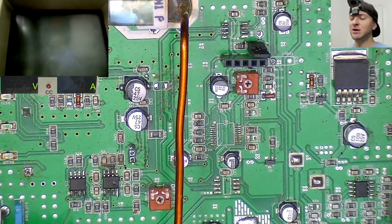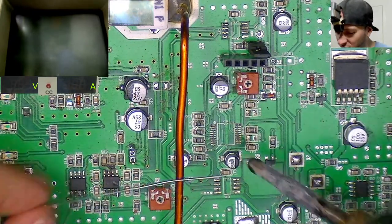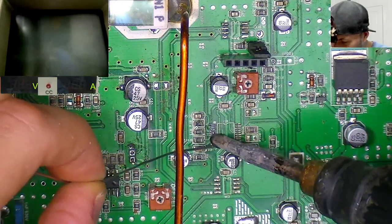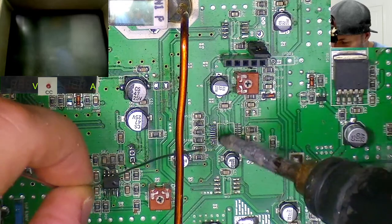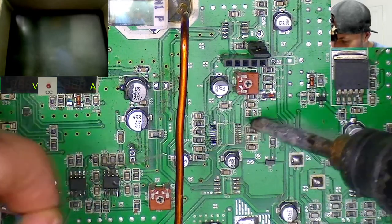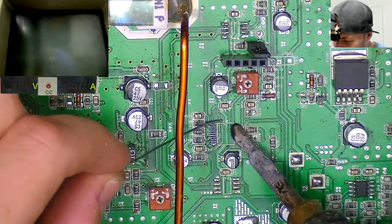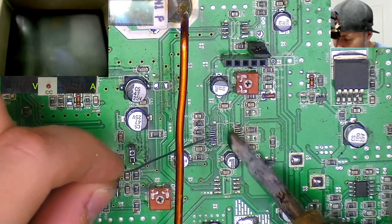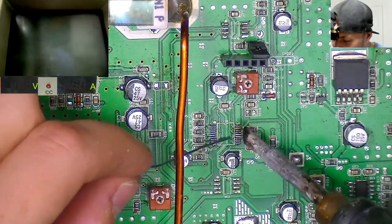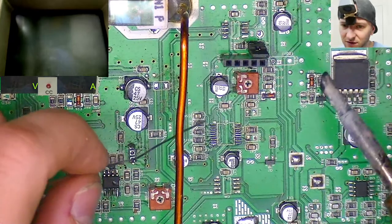So if you want, take the back off and send me a picture of the output inductors to facebook.com/bearids. I'll have a look and see if it's one of the ones with the weak inductors, where they have issues with vibration damage against the mainboard. If so, then you might have a fair bit of drive circuit damage and obviously output FETs you need to replace. Maybe it took the power supply down as well, but you also need to isolate the short on the output inductor. Really annoying. They have fixed that now. The later ones coming out, I do believe, don't have that issue. But yeah, kind of annoying, unfortunately.